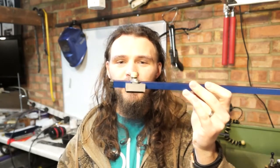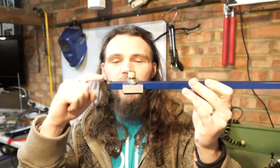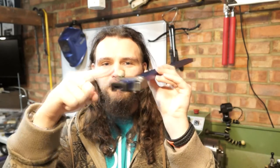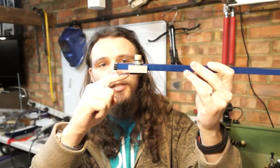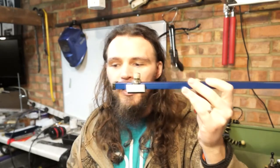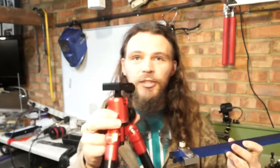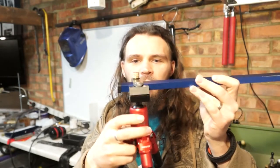As you might have seen in the previous episode, I've made a lot of this. What I've done is I've taken it a little bit further. I've made the brass knob, which I'll show you. On the bottom, I've taken a 45 degree dovetail cutter and put a 45 degree angle on here, which means it should fit into this particular type of tripod adapter, which is an Arca Swiss style tripod adapter.